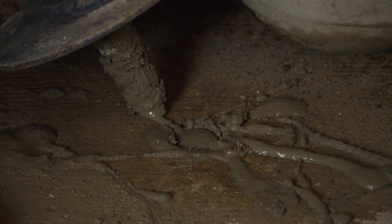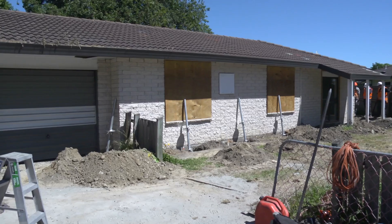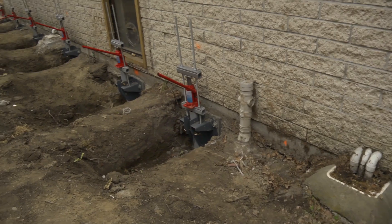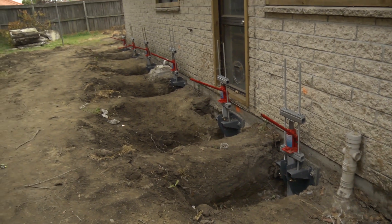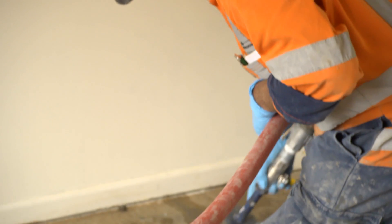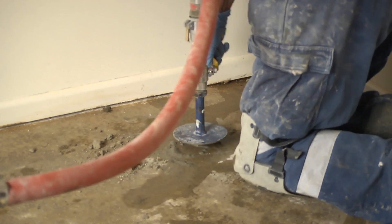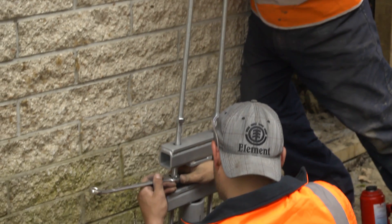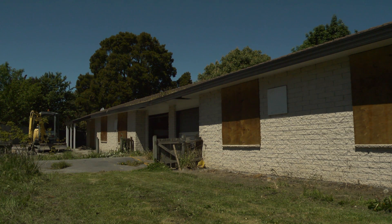The hole is then capped with a waterproofing agent. This is a room by room approach, starting at one end of the house and working along to the other. The process of lifting the house has taken up to five days to complete, and the void filling has taken another two days. It has proven to be cost effective in that the existing floor slab is raised and levelled while keeping the heavy weight roof and veneer intact.